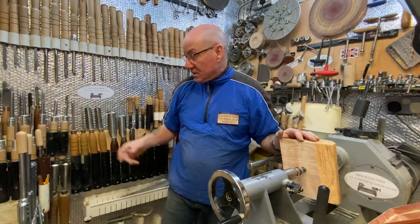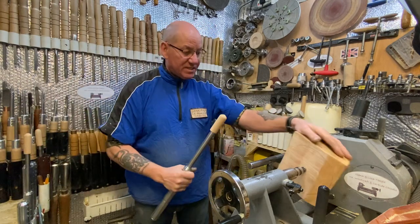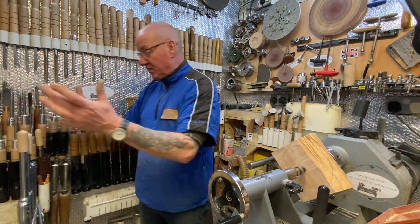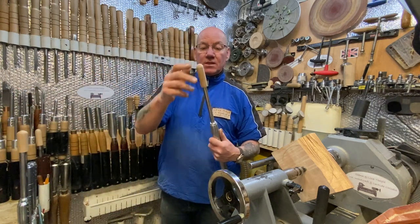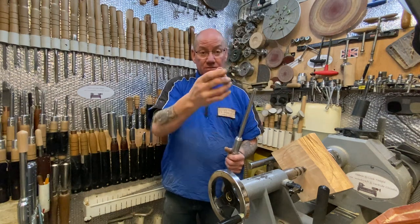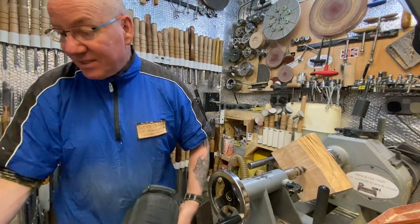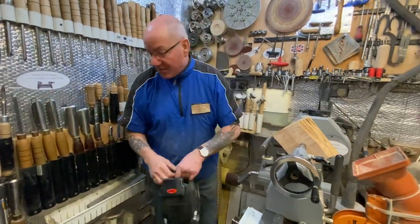Here's a quick tip, guys. I've got my chisels ready, these ones. I've put this in the aluminium handle because I want a bit of weight, because I'm just going to rough this down to round. I made some little tops for them, so they just go on, because when you've got your chisel standing up, you reach across to get something, and next minute you've sliced your hand. I've done them for the 16mm ones as well, so they just slot over. If you've got to leave your chisel standing up, just make, in literally 5 minutes, a square bit of wood, drill it on the drill press to 16mm, put it on the lathe, turn it, and there you go, nice little tops. I thought you might be interested. Just another little money saving tip you can do. It's money saving, because you think how much it's going to cost you in plasters when you cut your hand open, cut your arm open on it.